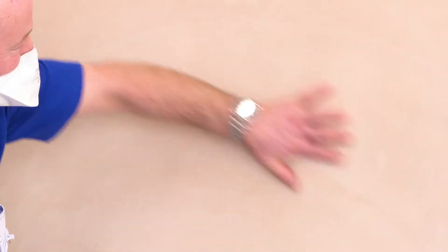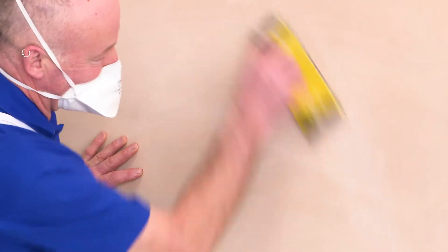So the first thing to do is get the surface prepped: get some dust sheets down, stick a mask on, and lightly sand the surface of the plaster with 120 grit paper just to remove any small imperfections and key the surface. If it's over shiny, the paint won't stick.